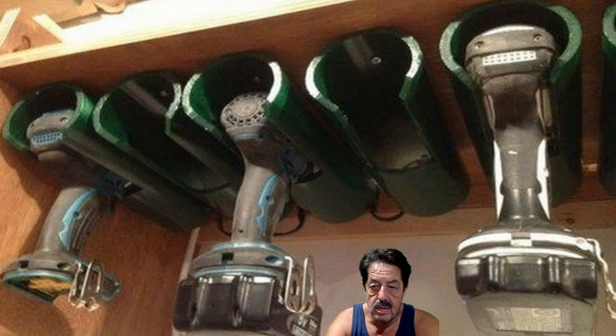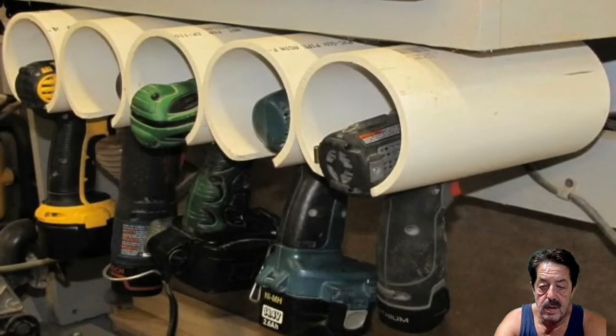Here's another one where the guy made those PVC holders and painted them John Deere green to match whatever else he's got going on in his shop. If I were you, I'd take 150 or 220 grit sandpaper and scuff the outside before you spray paint them — it's going to add better adherence to the paint. He did a nice job on these. Here's another one showing PVC screwed up underneath a cabinet in the garage — same concept, just different pictures.